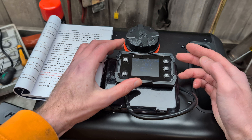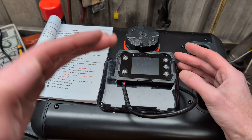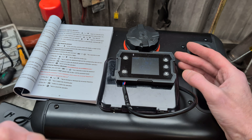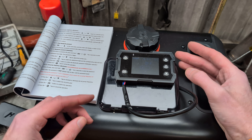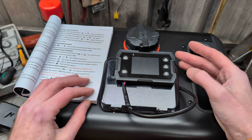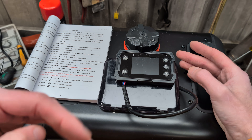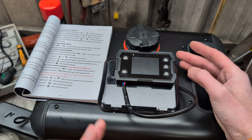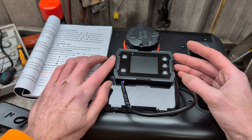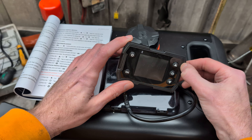This shows up in the carbon monoxide meter as a spike — it'll go down to a low number, then rise to a big number, then go down again, then back up. This is when you've got it set too low. So initially, if you've got a high reading that's staying high, that's a good sign you've simply got too much fuel and you can take it down. But if you're getting an all-over-the-place reading of up and down, up and down on the carbon monoxide, it's probably set too low. Try turning it up a bit so the burn chamber stays hotter, keeps the burn going, and keeps the diesel vaporized and burning efficiently. You tend to find that more at the bottom end of tuning. When people see a high reading of, say, 40 and take a quick reading without sitting and watching to see if it goes up and down — sometimes you can actually hear it in the burn chamber going on and off. Tuning the high end is a lot easier because it stays hot, gets hot faster, and your adjustments show up quicker.